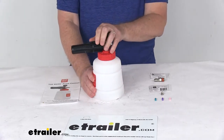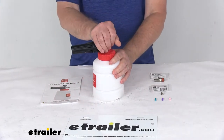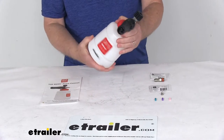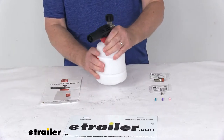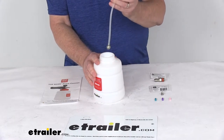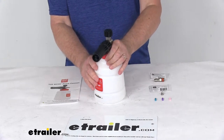This offers two types of detergent dispensing methods. The manual mix method will dispense a pre-mixed ready-to-use foaming solution. Basically you pre-mix a foaming concentrate prior to use — normally one and a half to two ounces of concentrate to thirty-two ounces of water — put it in the reservoir and you're all ready to go.